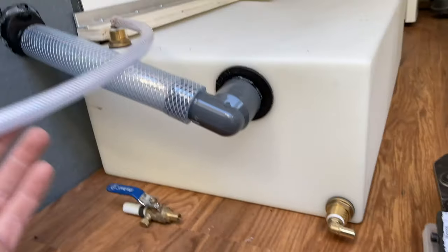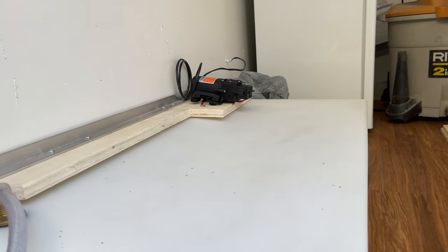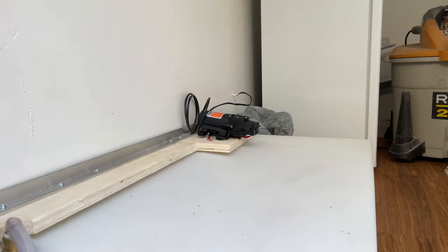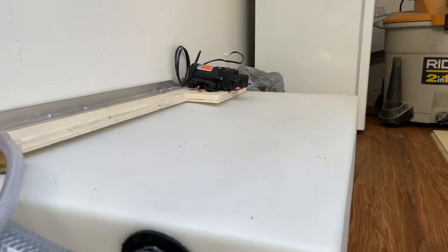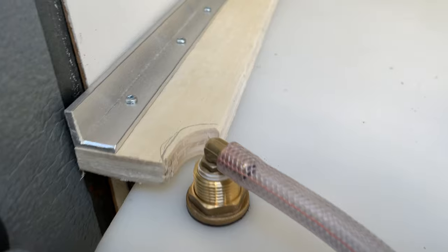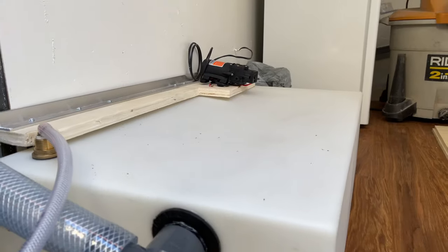One thing they mentioned is with these pumps, you need to have flexible line up to the pump itself. It's so that it doesn't put pressure on those little fittings, because this PEX tubing is actually quite stiff. So it could put a lot of pressure on those little fittings on those little baby pumps. So I'll do that. I'm just going to use a straight PEX connector, because what I found is you can just really slightly heat this up with a heat gun, and it'll fit right over top of half inch PEX, no problem. Like this right here. It just slides right over top of there. So you can use a combination of PEX and flexible line where you want to.